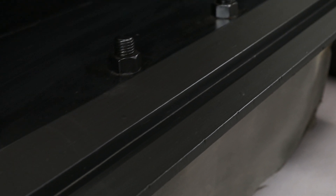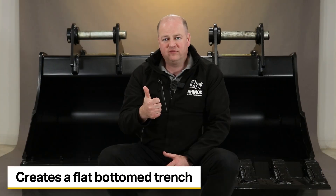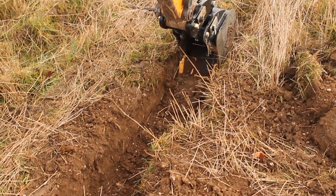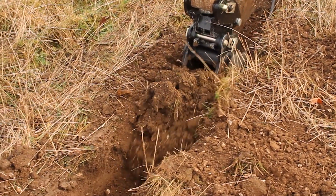Another key reason for having a bladed bucket is it gives you a flat bottom to the trench. For one, you'll be able to see whether there are any sharp objects — like stones or large bits of rubble — in the bottom of the trench, which could actually damage your ducting or your cables. It's imperative to have a flat base so that when you lay your trunking in there and when you're pulling the cables through, once it's been backfilled, you haven't got any uneven ground so that the ducting can come apart or break, which saves you having problems pulling your cables.